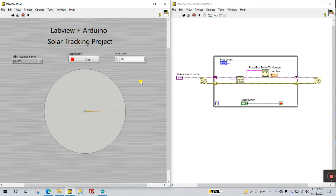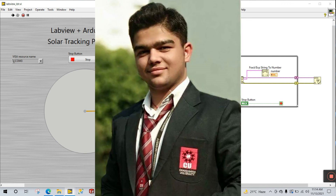One important thing: right now we are using a DC motor which has no encoder and cannot give feedback. That's why the value displayed in LabVIEW may not be accurate. In the next video, we'll try to use a servo motor instead of the DC motor, because the servo motor gives the perfect angle and provides feedback. We'll capture that feedback in LabVIEW to display the exact angle of the servo motor in the solar tracking project. Try to create this project, enjoy, and I'll make a new video about solar tracking using a servo motor. Thank you — if you like this video, please like and subscribe. Thank you so much!